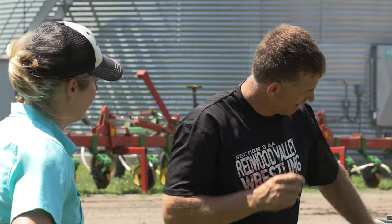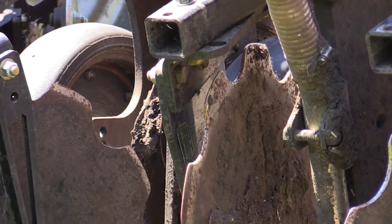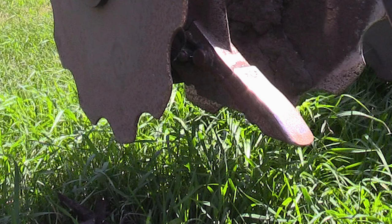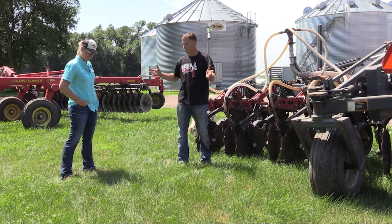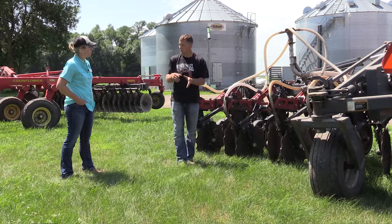I'm at a love-hate relationship with lumpy strips. Lumpy strips are good for winter because they stop erosion — they hold soil in place, it doesn't wash down a hill. Come spring you have lumpy strips and now I have to run my row cleaners lower on the planter to bust up these lumps. What I'm going to do is cut these shanks off, bolt on an adapter plate, and run different mole knives — more aggressive or less aggressive depending on conditions. A friend in south-central Minnesota has the same row units and did that. A mole knife instead of that two-inch shank point — you could run a mini mole that's almost like a bullet, or one with wings that lifts and moves a little more soil depending on your environment and soil conditions.